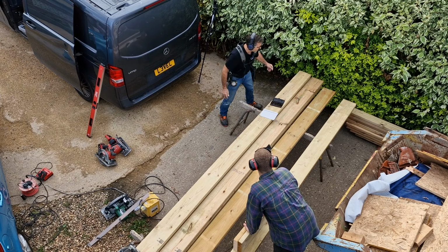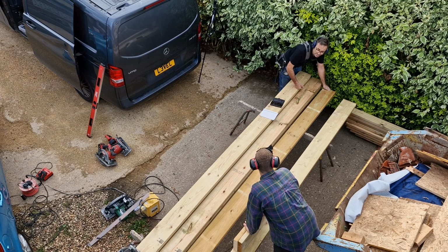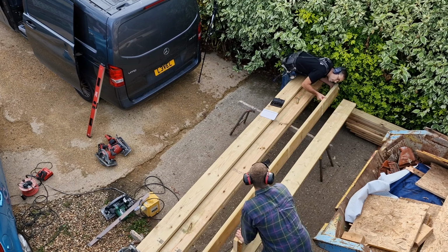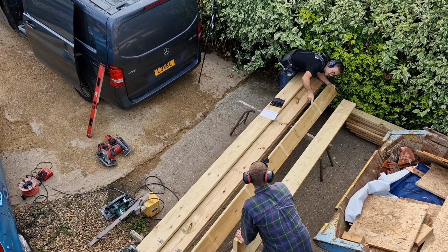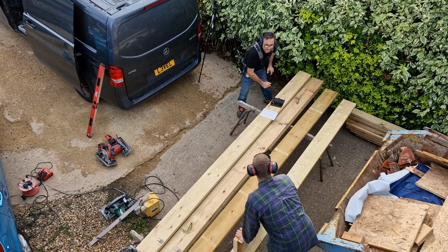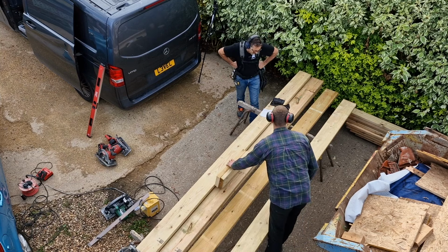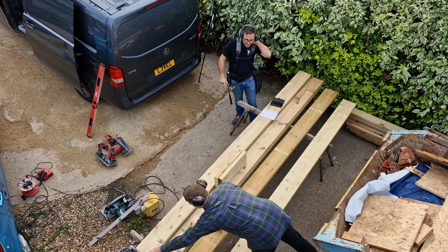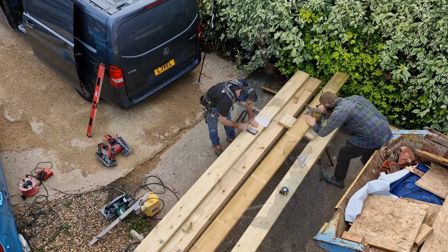What we don't want is the twisty hip ones. So this one's not great. That'd be all right as the short plate measured off that end, yeah? Yeah. And what's the short plate length? The short plates you want to be 3,150. We're going to cut them back again, but if you cut them 3,150, so take this end off.